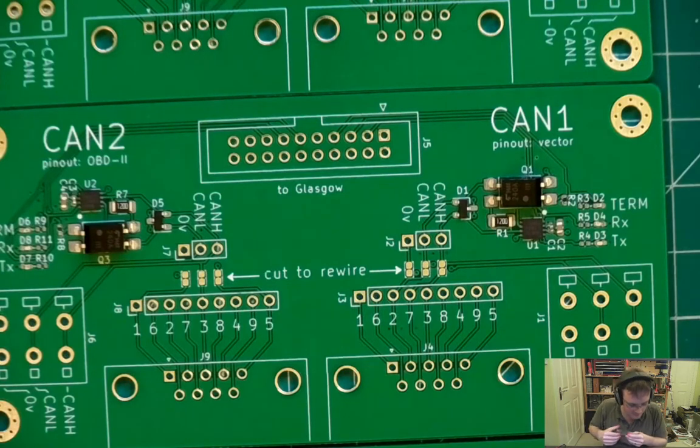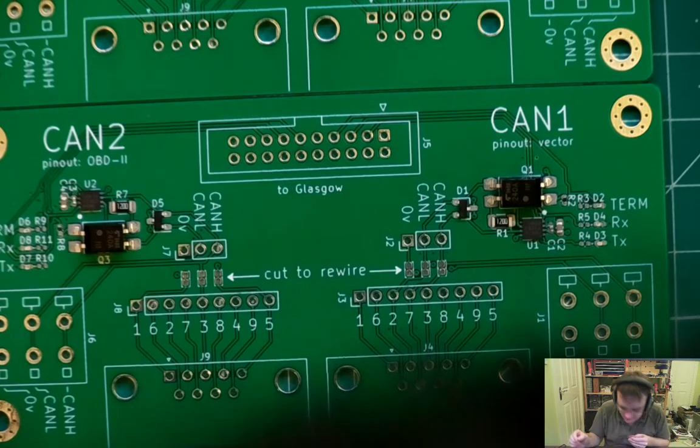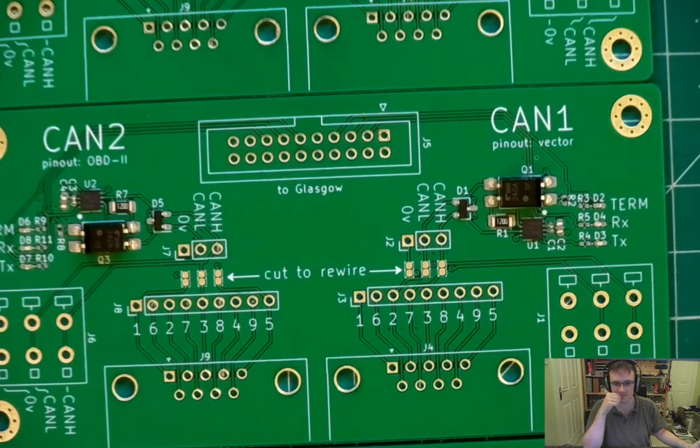We've only got three bags left — the three resistors, potentially the current limiting resistors for the LEDs. We've got 8.25K, 68K, and 30 ohms. Did I get a wrong one? 8.25 and 68K are correct. So we're going to be missing the termination LED resistor unless we want it really, really bright. Quick maths: five volts over a two volt drop is three, so 3V / 30.1Ω is going to be about 99 milliamps — that's way too much.